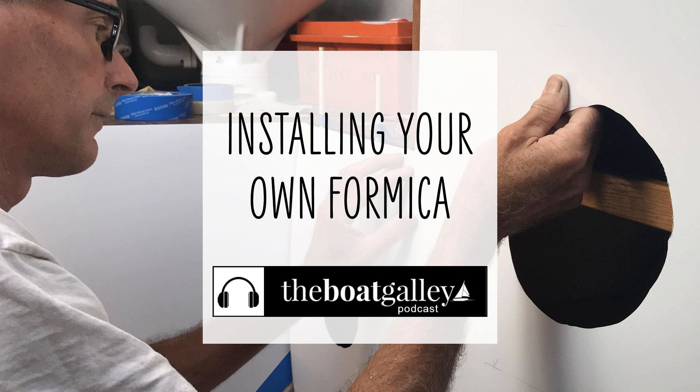Some people don't like the idea of Formica on a boat because their only experience is with the stuff you find in the hardware store that is pre-installed over MDF, which is basically pressed cardboard. But you can buy sheets of Formica and apply it yourself to whatever underlying substrate you want. Formica by itself is a sheet material made of paper infused with resin — it's heat resistant, smooth, very durable, and pretty waterproof. It cuts easily with a jigsaw or a router and comes in all kinds of interesting colors and patterns, and you apply it with contact cement.